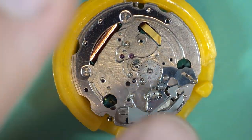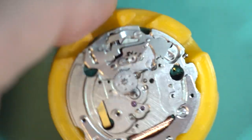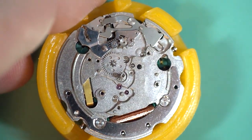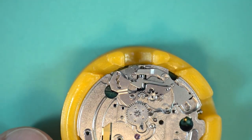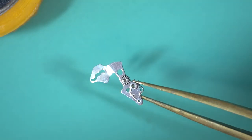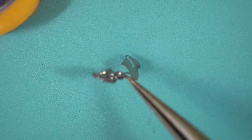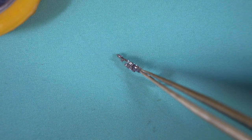You can see they're identical to a 6309. We're just going to pull the cannon pinion off, and there's the combination setting lever. In my opinion this is a work of art — just look at that, it's one complex part. If you have a look on the side you can see it's made up from several pieces.